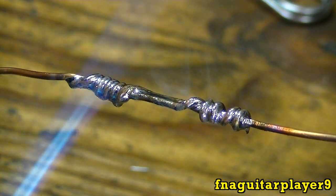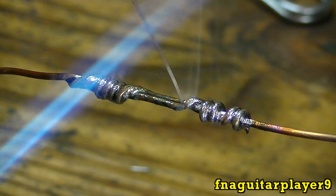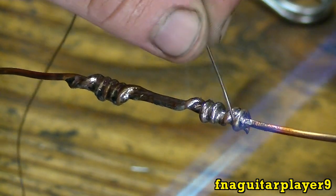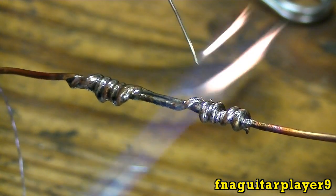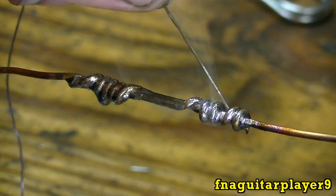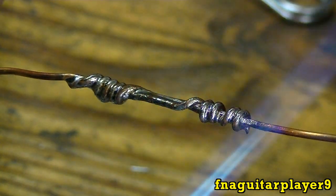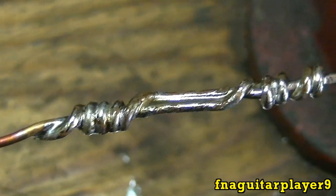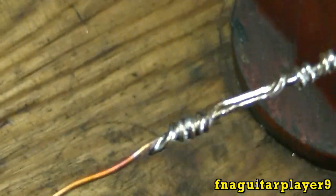This has been tested by NASA and several other tests. They say when you splice it like this, the splice is stronger than the actual wire. If you're going to do a strength test on this, the wire itself would break before the splice — that's how strong this is. This solder doesn't want to flow the best because it's so small. If you had a thicker solder, you'd be able to get it to build up better. You can see it's about the best splice you can do, really. That's why I wanted to show it first.